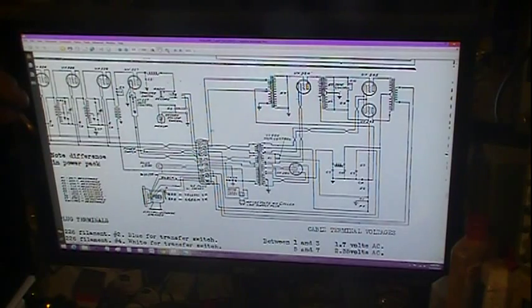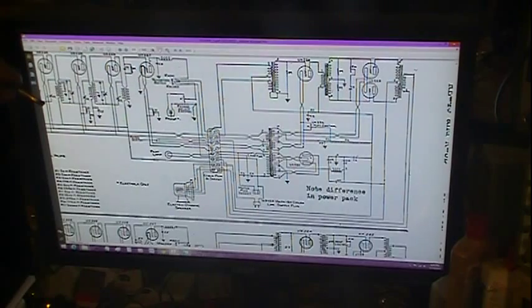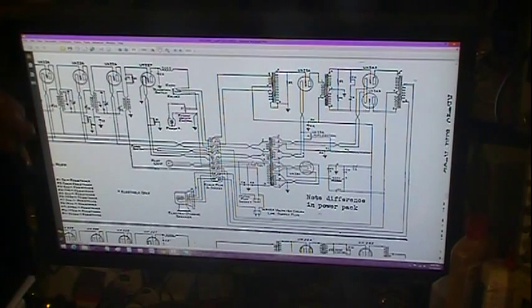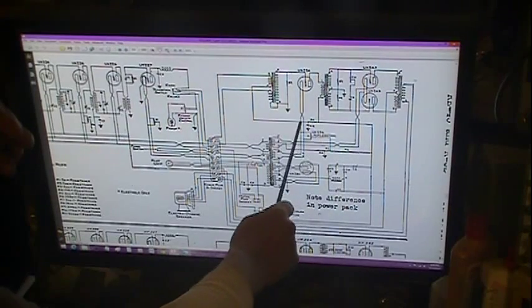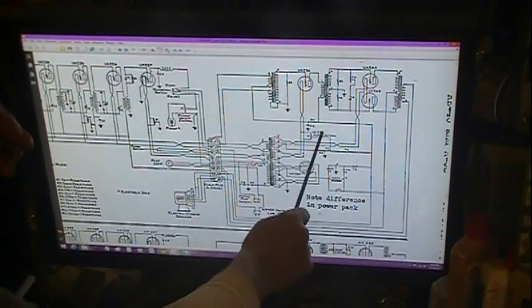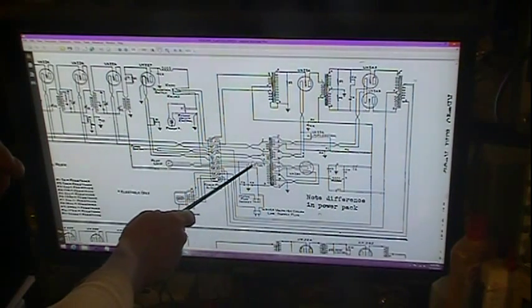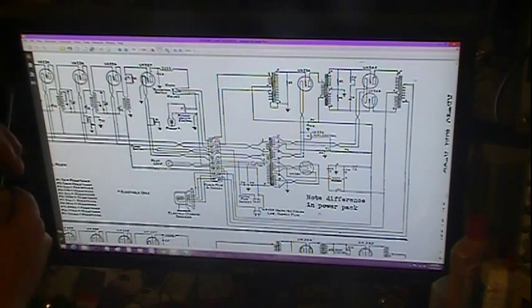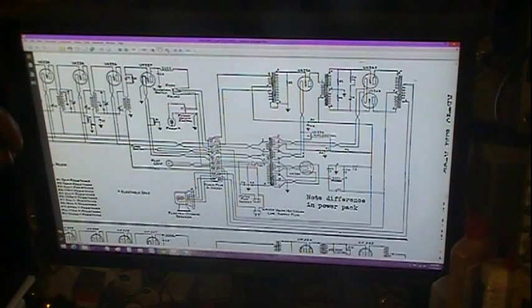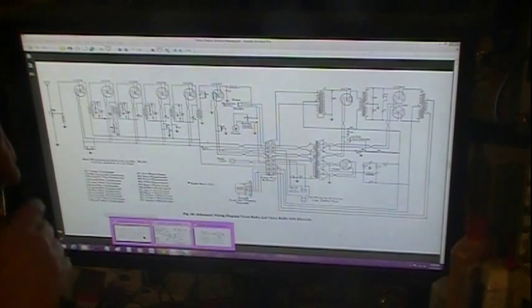But on this same page, out of Riders, there is another unit. Now it's using the other resistor like it shows in the service manual, and it has R11 and C12 here, this filtering thing, but it also has a 2 amp fuse in the primary line. So it actually had a line fuse, whereas on the service manual they do not show that. There's none on this one.